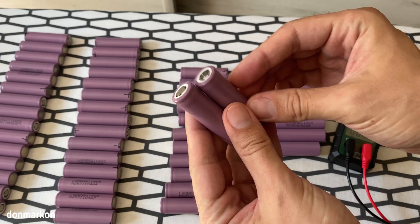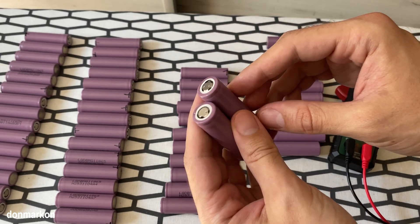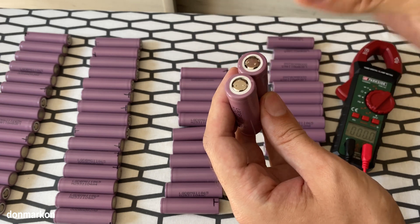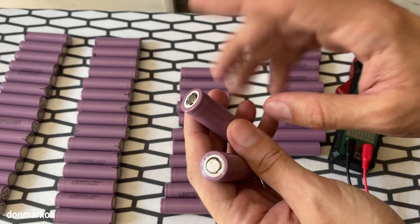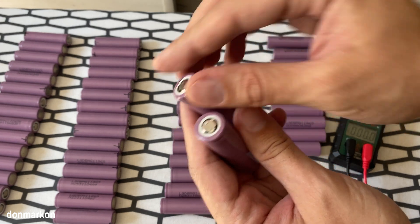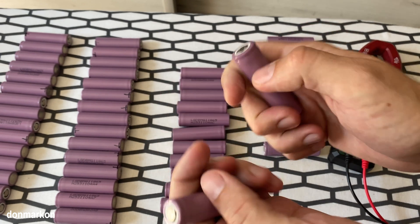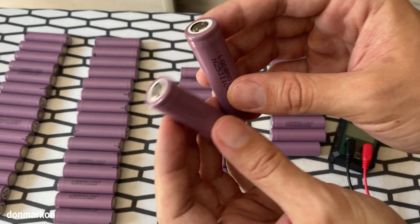One really important thing that can help you in this dangerous procedure: in my experience, in 95% of cases, if the cell was triggered by heat or just by resting for a long time — like these are eight years old — the pressure buildup will trigger the CID. When you press the cap underneath, if the cell has voltage and is probably healthy to use, you're going to hear a sound. Gas is escaping when you press the CID. In my experience, 95% of the time when you hear the sound, the cell has a resting voltage between 2.7 and 3.2 volts depending on the cell, and those cells are usually perfectly fine.